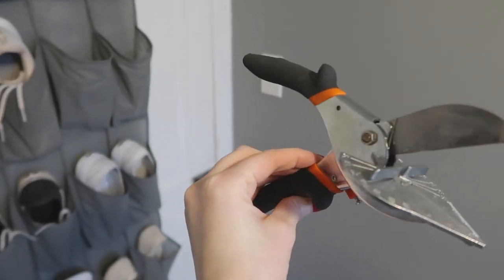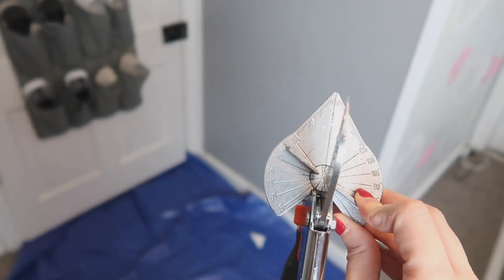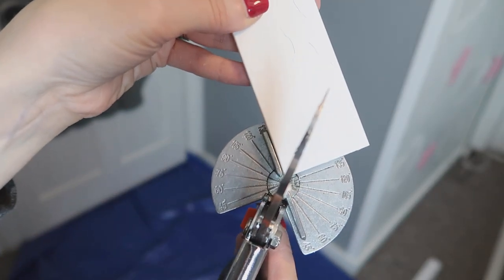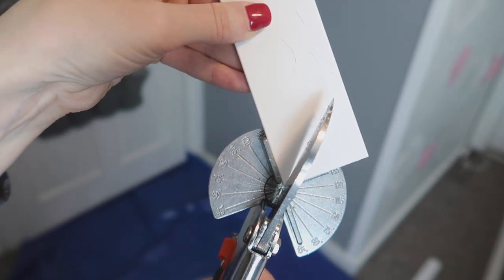To cut it down I'm using miter shears — instead of a miter saw or a handsaw and miter box. You can find these on Amazon and I'll link them in the description box below. These are so handy whether you're crafting or doing trim work. Miter shears are basically a big blade in the middle that works like scissors, but they have a bar in the middle you can click to change the angle. You sit your material into that angle and chop down with the blade — and these blades cut through PVC material like butter.